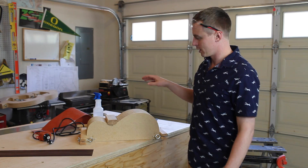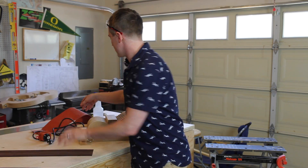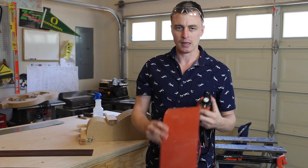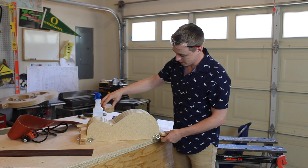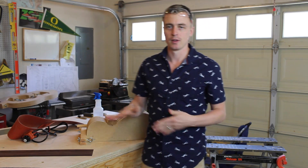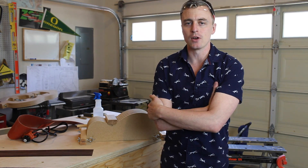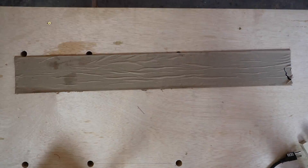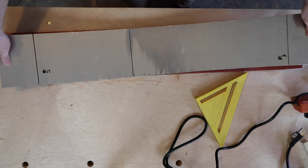Pretty much how this is going to work: I sprayed this with water a couple minutes ago so it's nice and wet. I'm going to heat it up with this silicone heating pad — I'll put a link in my video description. It heats up to about 300 degrees. Then I'm going to wrap the side in paper, wrap that in tinfoil, sandwich it between aluminum sheets with the heating pad inside, plug it in, and clamp it to this jig I built — clamping the center first, then the ends, so it bends into shape and holds.